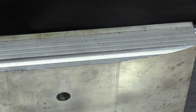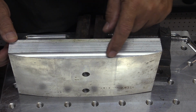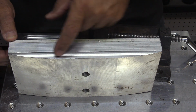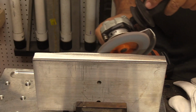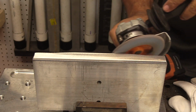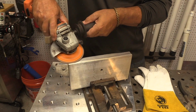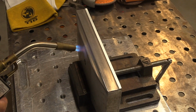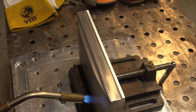This video is about doing build-up repairs for mismachined parts or aluminum castings or dirty aluminum, thick dirty aluminum. It's about letting the cleaning action of the arc work for you, but also about cleaning the aluminum prior to welding. So I hit this with a flap disc just with light pressure, and then I wiped it down with acetone, gave it a small preheat because all I had was a handheld propane torch.